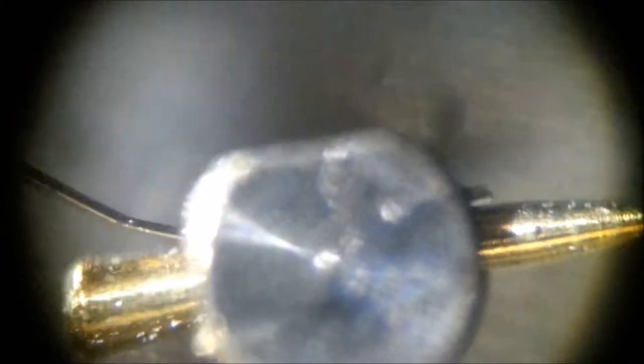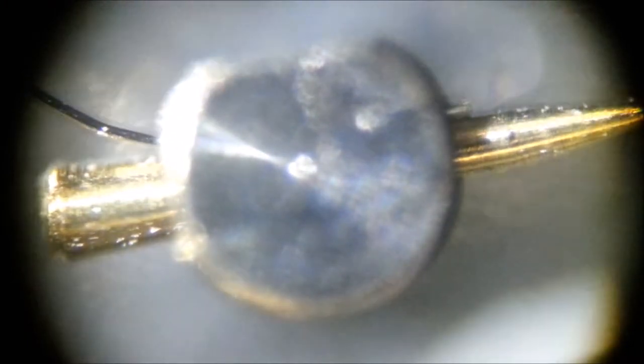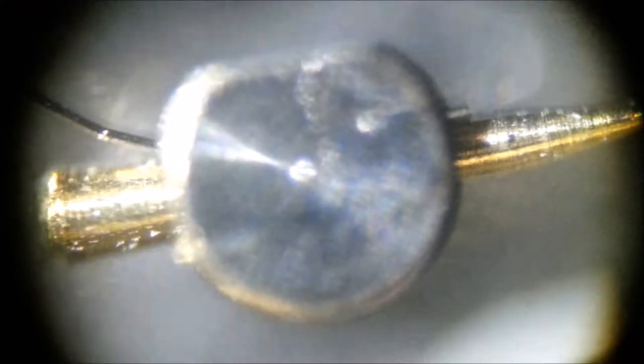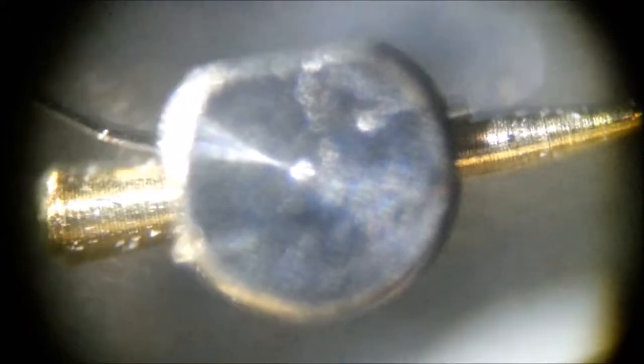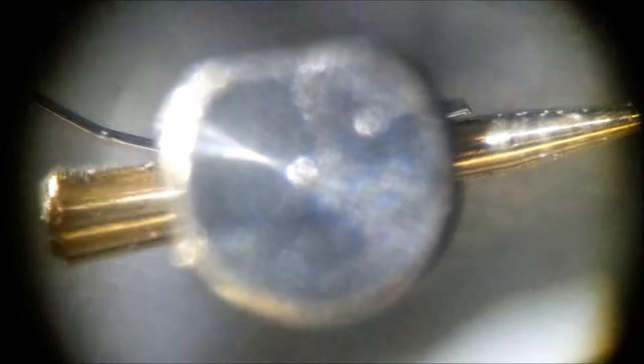Sorry for the bumps. That spring right there is about the width of a human hair, so it's a very tiny spring, and I wanted to replace the spring on it. The little wedge piece right there gets driven into a point and it holds the spring in place. So there's a little mount, and on a couple of the other watches you can see the other side of the mount above the speed adjust system where that spring gets put in, but that little wedge is incredibly small. I mean, it's a very tiny wedge. Obviously, I'm using a microscope to observe it, but it's one of the smallest pieces, probably if not the smallest piece, in a watch.